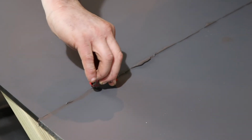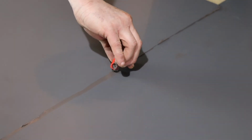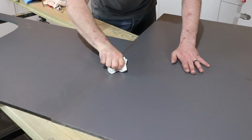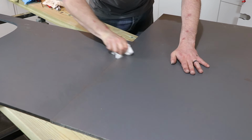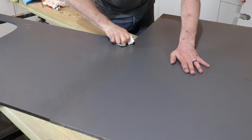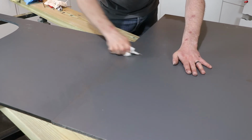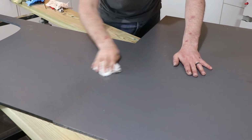Quickly remove the excess TopSeal with the scraper and use a finger on the front edge. Clean up any final TopSeal with a dry white cloth. If the worktop is heavily textured, it may be necessary to use acetone to finish the cleaning process. TopSeal should take no longer than 4 hours to fully cure. As you can see, the adhesive has matched perfectly, creating a seamless joint.